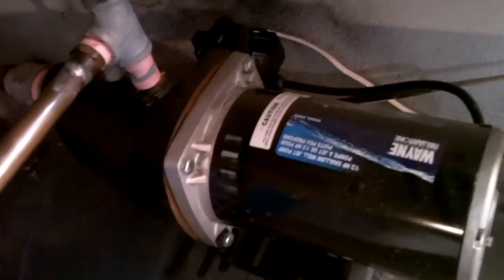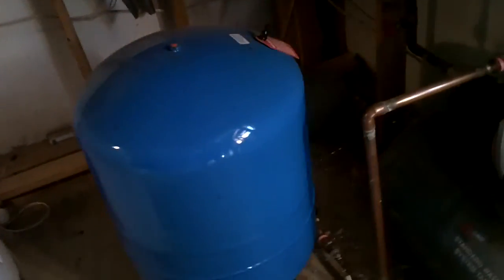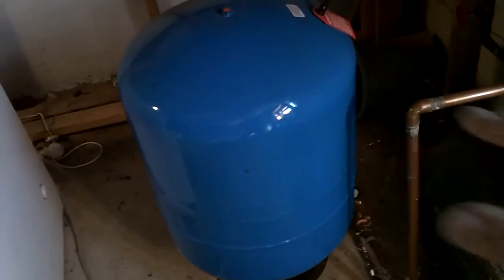To keep the water from running constantly to pump water throughout the house, the jet pump pumps the water down through here and into this blue pressurized bladder tank. This bladder tank is kind of neat — it has a rubber diaphragm like a balloon inside.